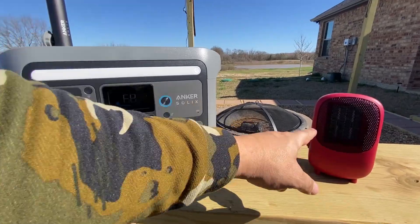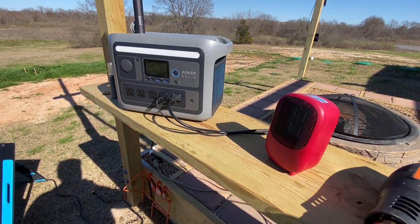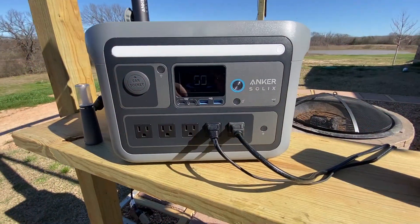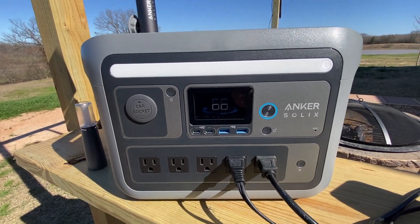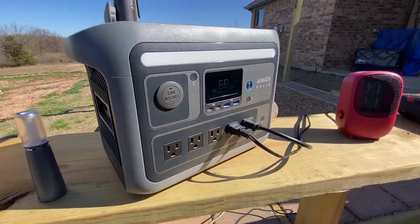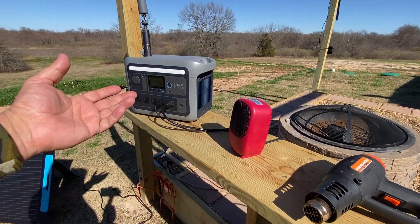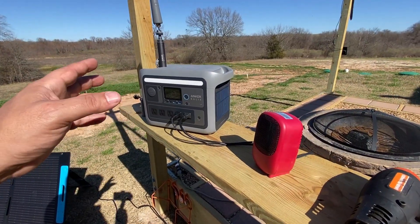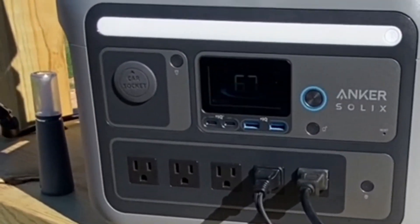I have a small 400-watt heater — the unit is putting out 400 watts. I then add a heat gun on its low setting, and now the unit is putting out 771 watts. I unplug this from the household plug and there was no power interruption, which is great for devices like computers. It is pure sine wave, so it's completely safe and will not damage your sensitive electronics. I then try the heat gun on the high setting — and there we go.